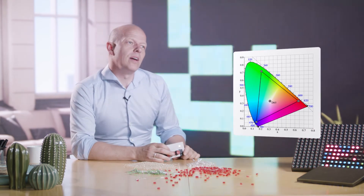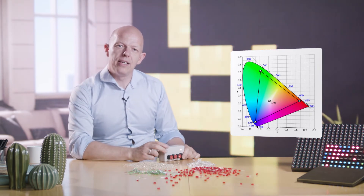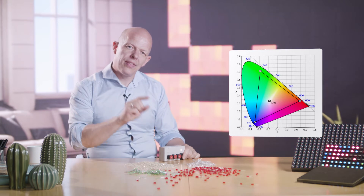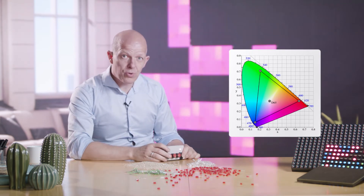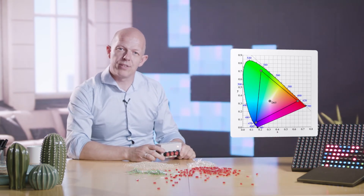Take a look at the color spectrum over here. In the lower left corner you have blue, in the lower right corner you have red, and in the top you have the green primary color. The triangle clearly shows that any colors within the triangle can be mixed out of the red, green, and blue colors. It also clearly shows that all the colors outside of the triangle cannot be mixed by adding red to, for example, the green or the blue color. To get the best possible image quality, you need to cover as large an area of the color spectrum as possible — that's why the red, green, and blue LEDs must be as close to the edges of the color spectrum as possible, yielding the largest triangle.